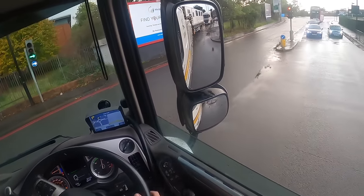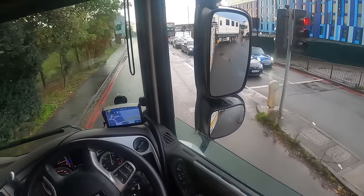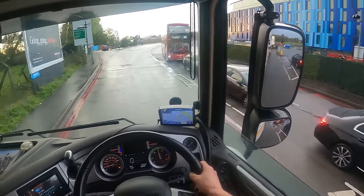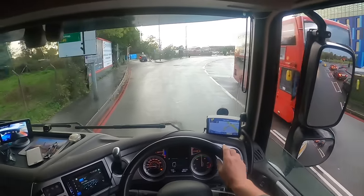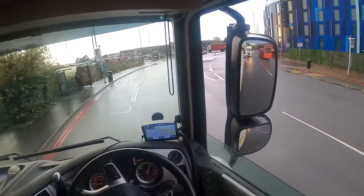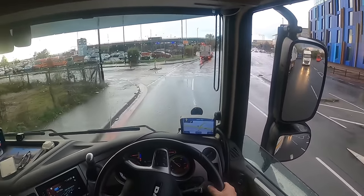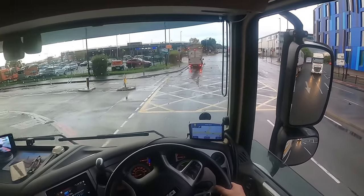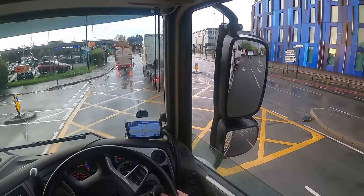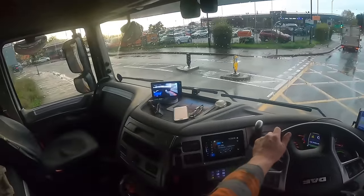There we go. I'll get a little bit better view of it around here. Slightly turning round the steer axle just brings it around quite nice, really. But these axles are live all the time, so towing forward they're fine. Reversing, sometimes if you get a little bit of a lock on to get into a bay, obviously the wheel's turned quite a lot at the back, and when you want to straighten it up, it still keeps turning, so you might have to shunt forward a little bit to get the whole lot straight, then come back again.